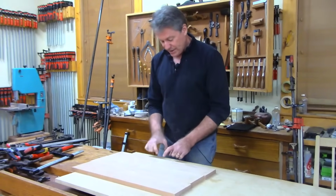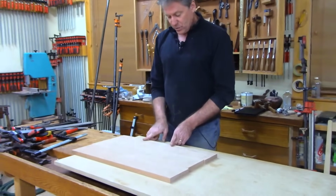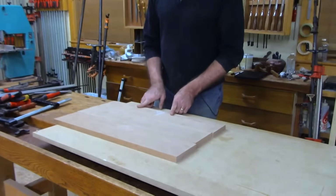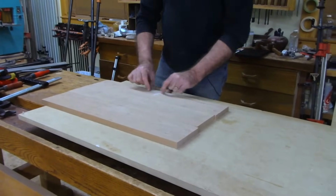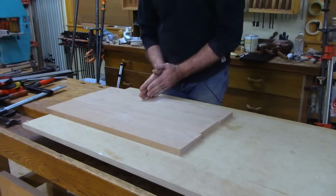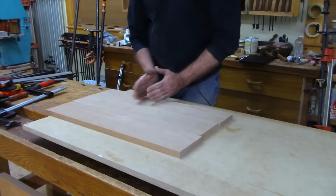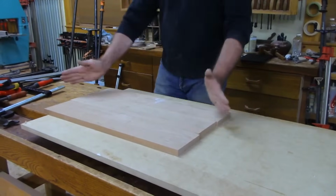So when you crank down on that, if it's sturdy, the pressure is actually exerted over a wider area because it's rigid. You can imagine if you had a bunch of narrow strips and you put pressure on them, that pressure is more narrow going through, but the spine of that outer caul distributes pressure well.